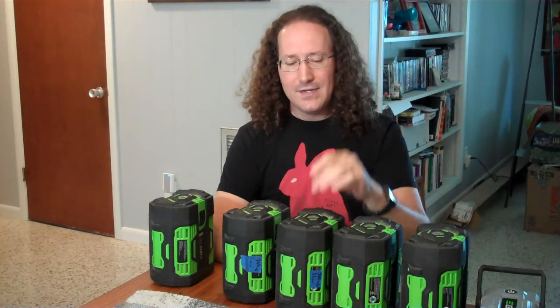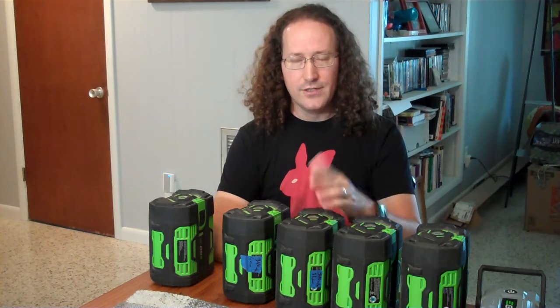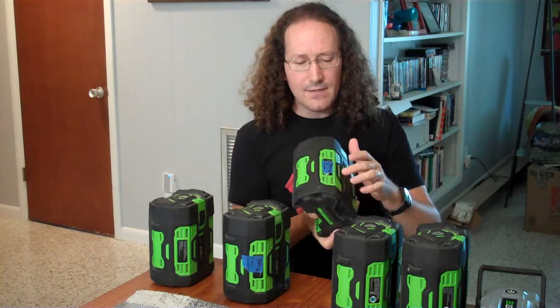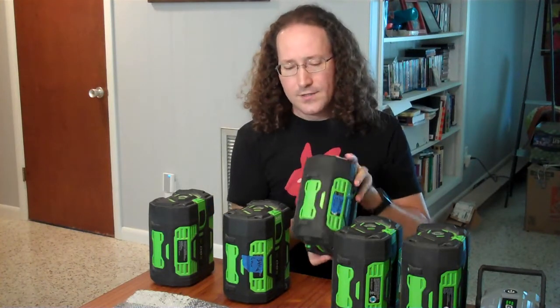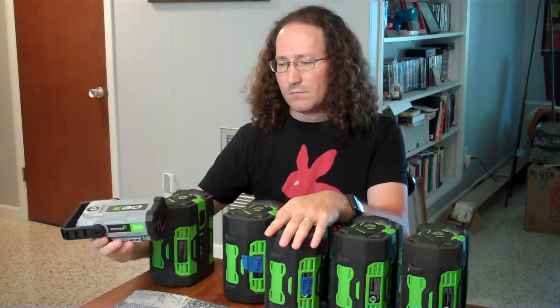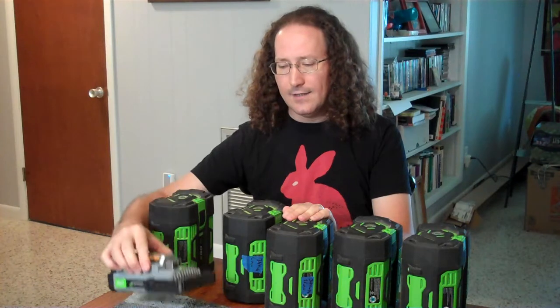The one I bought new worked great for three years and a month. But at that point it started having a problem where it would run the motor for maybe 50 feet and then immediately start flashing red like it had hit the low voltage discharge warning, but it hadn't actually fully discharged. I have a blue piece of tape on it that says '340 watt-hours slow.' If I discharge it fully and slowly — drawing 60 watts or something — it'll charge cell phones, run a little refrigerator, or run a Wi-Fi router for hours, delivering about 340 watt-hours before it needs recharging.